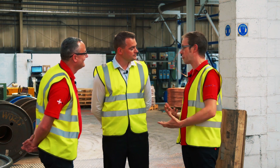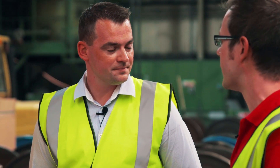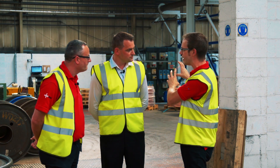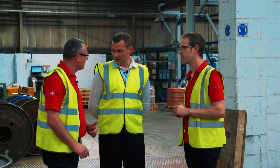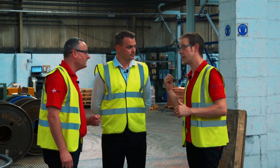We're at the start of the manufacturing process at the wire drawing facility. The process involves taking 8mm diameter copper rod and drawing it down into the various smaller diameter wire strands needed for the rest of the cable manufacturing process. One pallet of the pre-drawn copper rod weighs around four to five tons — so that's a huge drum of copper to start with, and it gets drawn down into really fine strands from there.